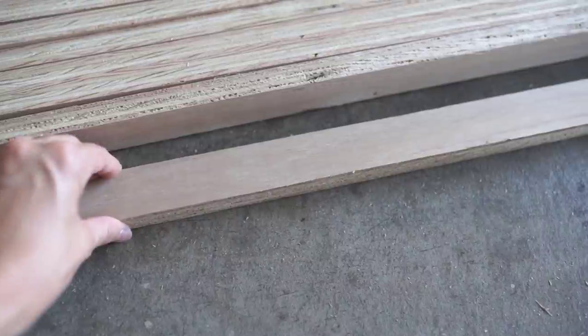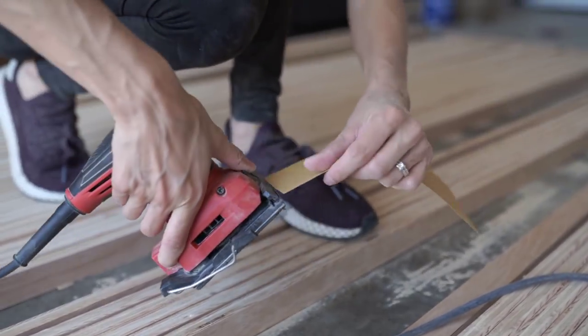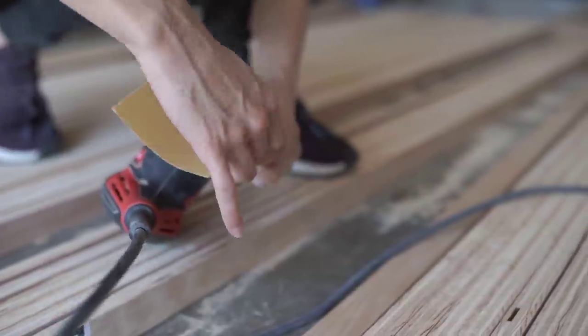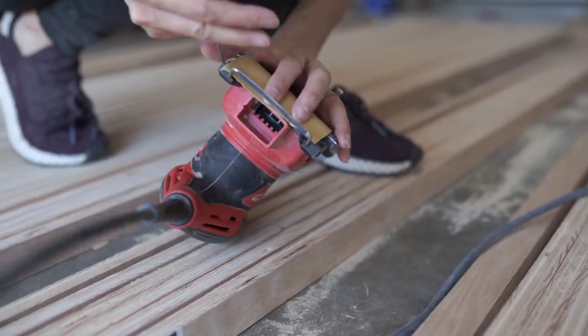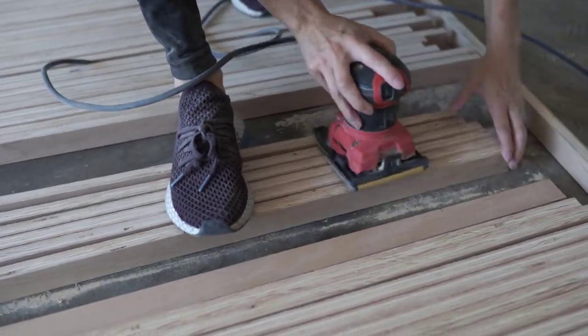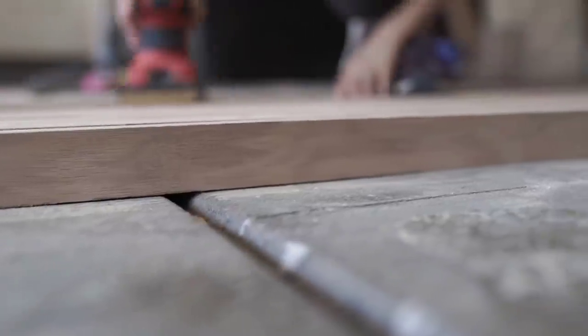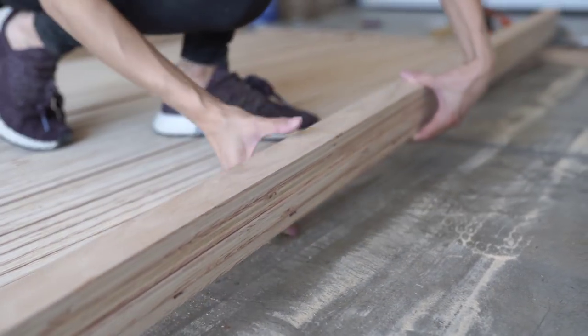Once we got the wood slats cut down, there was a little bit of splintering — the edges were a little rough — so I took my sander. I just lined all of them up on their sides and took my little hand sander, which I will link below. I just sanded all of those rough edges and made them smooth, so when you run your hands down it you're not getting splinters. The plywood we used is a red oak plywood. Normally I probably would have bought birch, but they were all out of stock, so we settled for the red oak and I think it looks really interesting — it's still a little bit warm, so it worked out well.